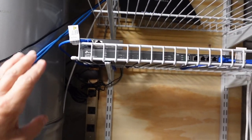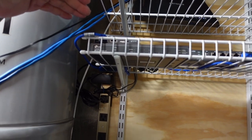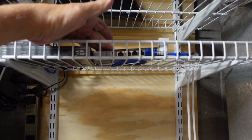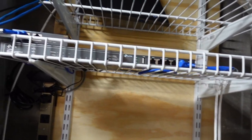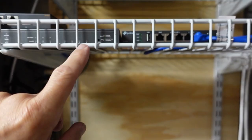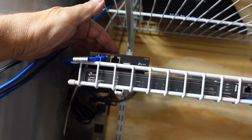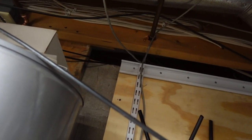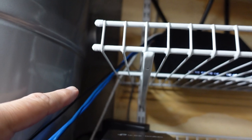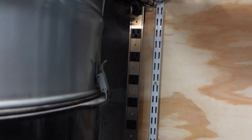We're back in the noisy room. Now, I did hook all of these together, and they do seem to play nicely with each other. This is the router, which I need to run the cable from the fiber modem over to here. That feeds in, and then this is a PoE switch, so this powers the controller, and the controller manages all the connections. The connection for the upstairs access point is this one that I've routed down here. I also mounted a power strip along here that will be hooked to the UPS so that everything powered by the strip will be covered by the UPS.